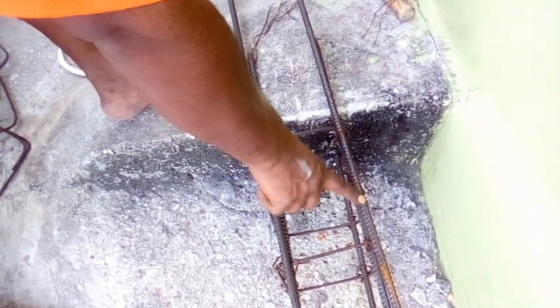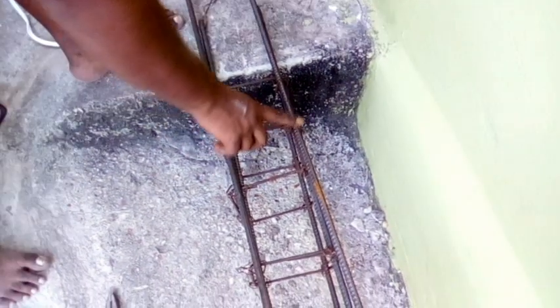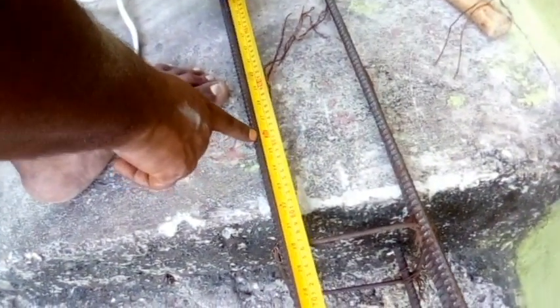And here now, we're going to build our next bar like this. Now this, you see in here? This has to join with this steel here for it to get strength. So we're going to join in this inside of this steel here. So we have at least 4 feet of steel. Well, 3.5 feet of steel will be going in, and the bars are going to stop right here.